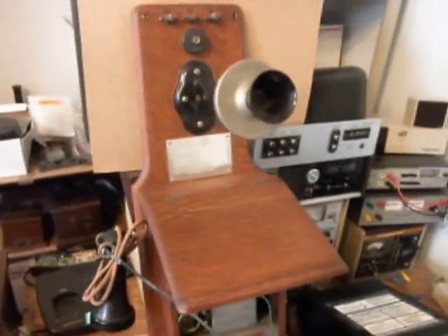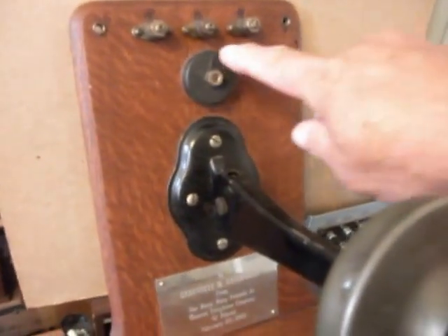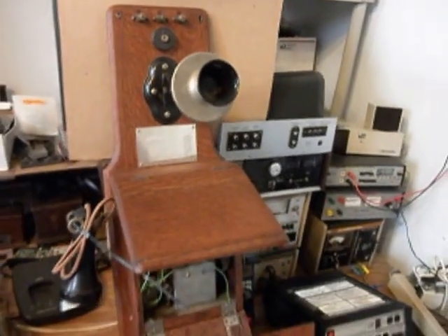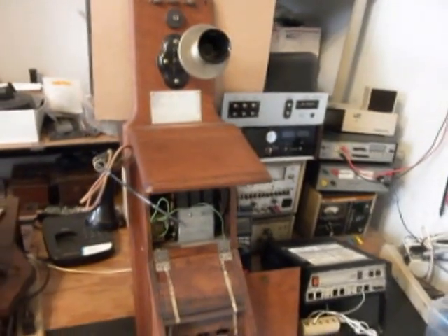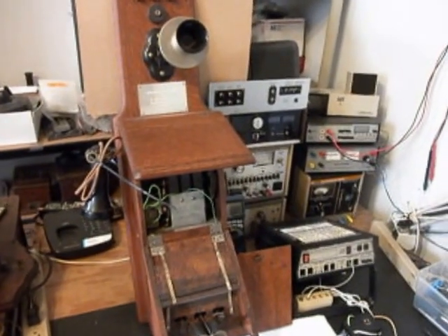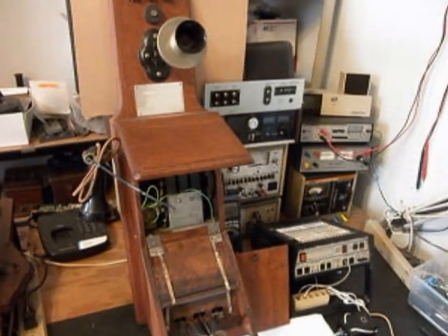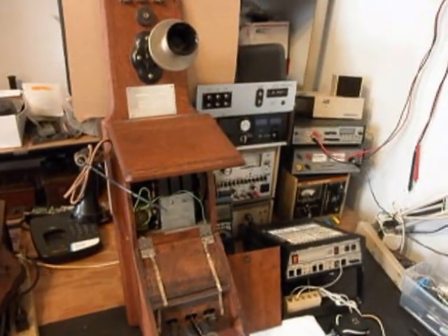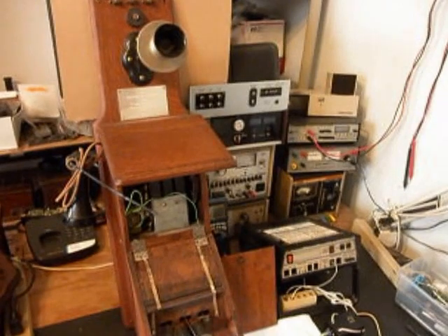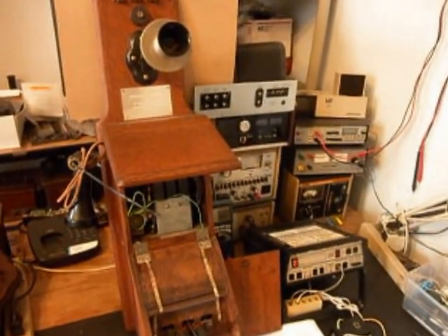This gives you some look at it — it has its open connections on the top and your lightning arrestor. We're also going to be installing a modular port adapter on the inside of this telephone so that William can simply open it up and bring a line cord in any length, any color, and simply plug into a modular port. Then he'll have a keypad in the bottom area. We're going to go ahead and get a start on this telephone and get more video as we move along in the repair and conversion.